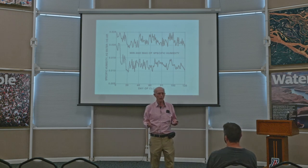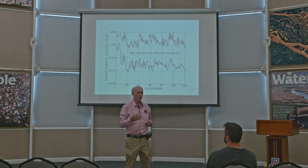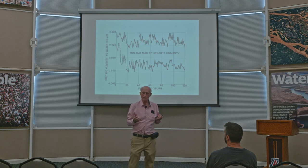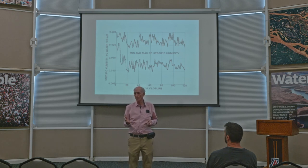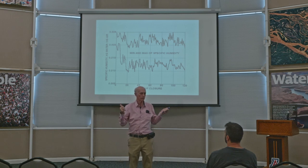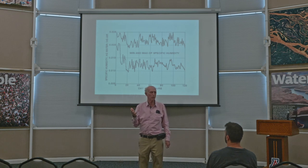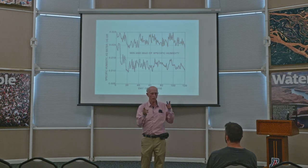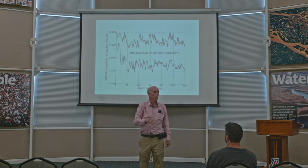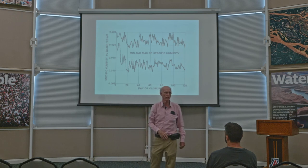So all of these are creating pressures. Now, if you just do the simple back of the envelope calculation on the basis of the ideal gas law, which people learn about in high school, nothing very sophisticated, you very quickly find out that the pressures that are created are so much that they would destroy this structure. They're big. There are a lot. And I'm talking about like 100 pounds per square foot. You know, a square foot, 100 pounds, both directions, outward and inward. So it could either explode or it could get crushed.